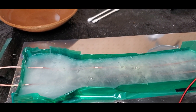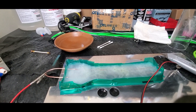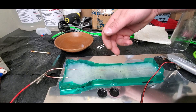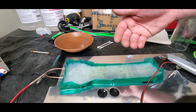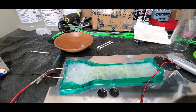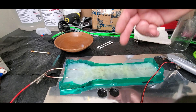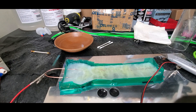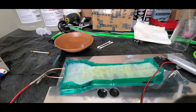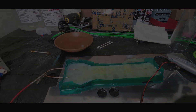If you're going to do it this way, keep in mind that when you pass electricity through salt water and it bubbles like that, the gas being given off is hydrogen gas. That's how it's made through salt water electrolysis. So make sure you're either doing this outside or in a very well-ventilated area. I have a fan running — I just had to turn it off for recording. I'm going to leave this sit for about an hour or two, topping off the water periodically, and then we'll come back and see what we got.